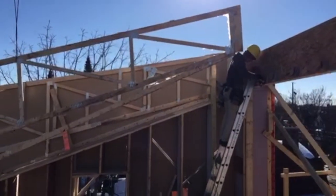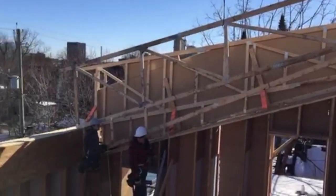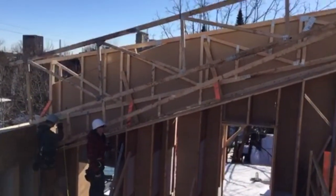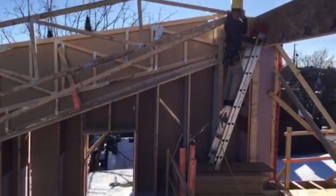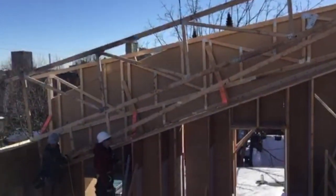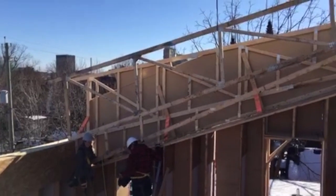Moving all the hangers again? We're scrambling with the hangers a little bit, guys, because we ended up with 13 trusses when we thought we were getting 15, and we changed the design last minute to build a knee wall on top of our outside walls. So it's why we're checking this now. Bear with us here. So I can move it over.